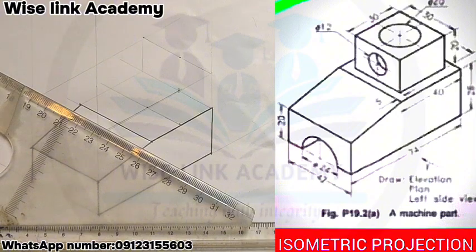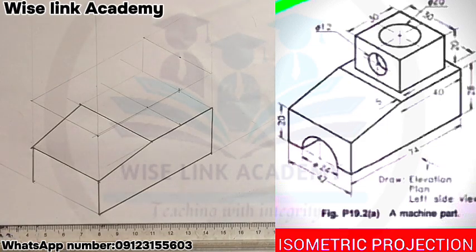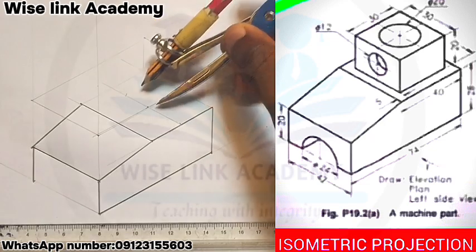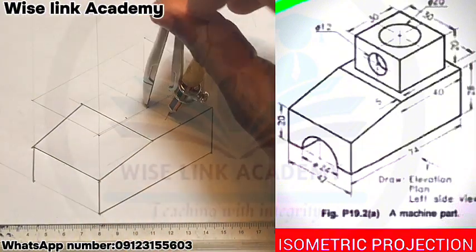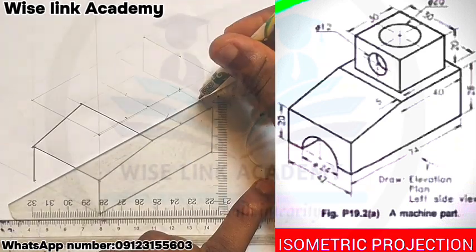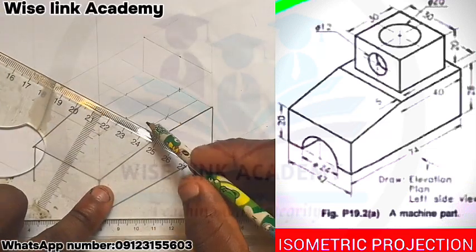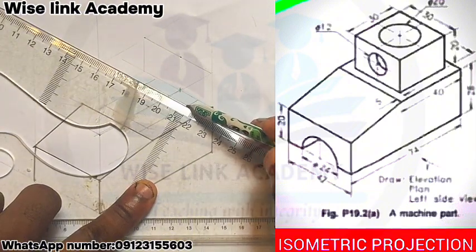At that point, I'm giving the square box to be 30, so I'll measure 15. Taking my compass, measure out 15, as in this case. I'll come to center here, strike an arc 1, next up 2, 3, finally I have 4. With these 4 points, I will project them this way to create that box, this one this way, next up, this one here, take it down this way. Next up, I'll take this one here, take it down, take this one here too, take it down this way.